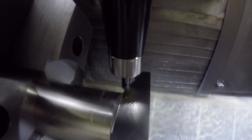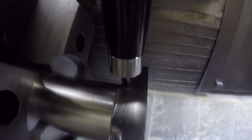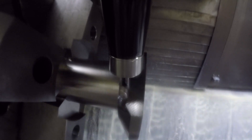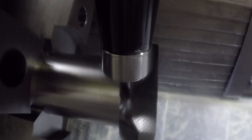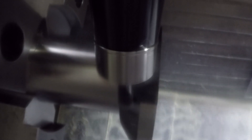This style of milling works really well for roughing out slots in materials, particularly in exotic materials. The end mill tends to cut on the side of the flutes with a shallow depth of cut more easily than cutting deep pecks in a slotting operation. It takes a little longer than slotting normally would, but it's easier on the tool — the tool will last longer. So it works well to slot out material this way.